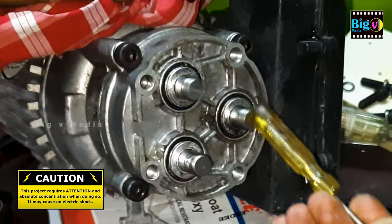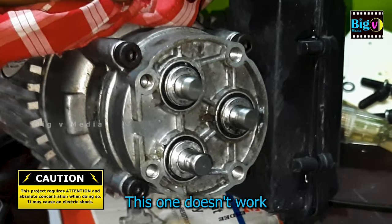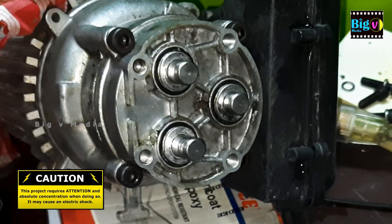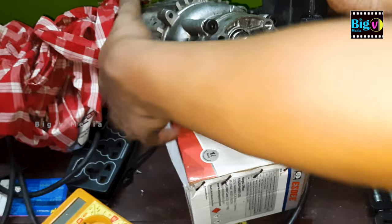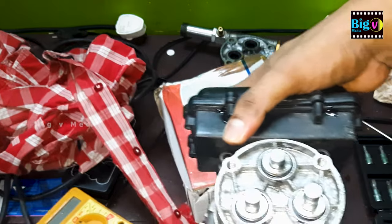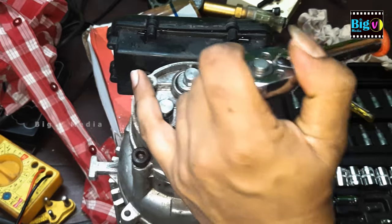This lack of movement may point to a broken spring responsible for pushing the plunger backward to the wobble disk — a common problem that needs prompt attention. In certain cases, a spring may break on its ends, making a visual check misleading. During a visual inspection, the plunger may appear to act normally. However, in a closed condition, the partially broken spring prevents the plunger from moving entirely backward, resulting in a drop in water pressure due to reduced plunger movement. To uncover such hidden issues, we'll carefully use the screwdriver again to detect subtle differences not apparent through visual inspection alone.